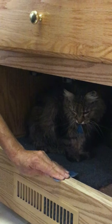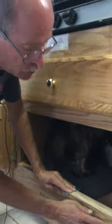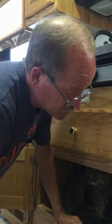As you can see I am sanding — going back and forth gently — and Julia is supervising. What I'm trying to do is remove the top surface of that vinyl so that when I put the stain on it will adhere to and suck into the wood. Once I'm done I'll vacuum up all the sawdust inside and outside. Speaking of clear coating, you have to decide what kind of sheen you have on your furniture: gloss, semi-gloss, or matte. I chose semi-gloss because it's right in between.